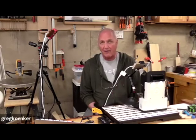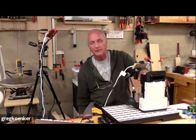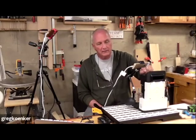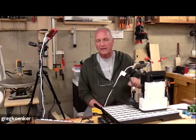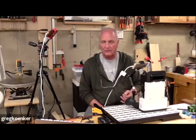I have a 1/2 inch shank one. So I suppose if you could find a 1/4 inch shank, you could do that, but you'd have to be careful that it's not too big a diameter and so forth. I will point out, if I didn't mention this before, that the parent company of the Origin is now also the parent company of Festool. The router motor in the Shaper Origin is made by Festool, so there's a Festool 8 millimeter collet that fits the Shaper Origin. That's where I got an 8 millimeter. I don't know whether Shaper sells them now, but they didn't in the past.